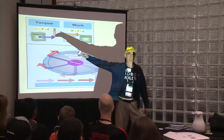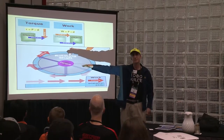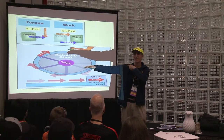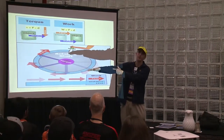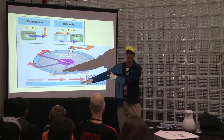Distance. So if my arm is a robot arm, what would I measure to figure out the torque? The distance of the radius. Is this from here to where? That's where usually people make mistakes. It's actually where the load is, or my arm is the load. It's the center of mass of the load. So it's not to my fingertips, it's to the middle, when you're doing that.